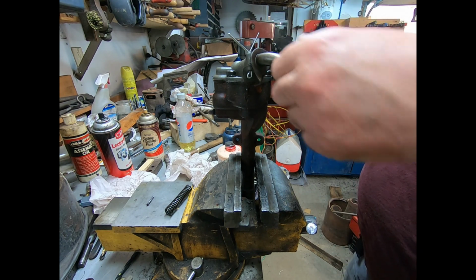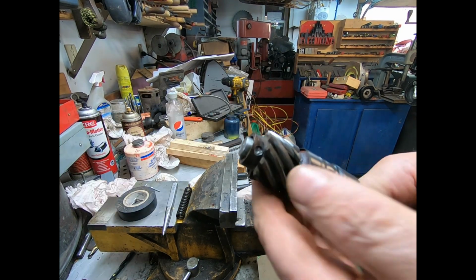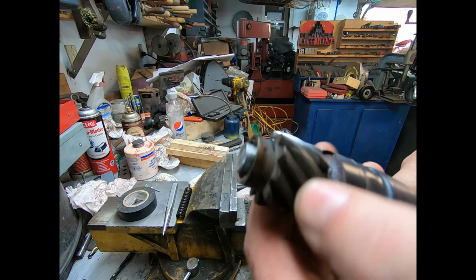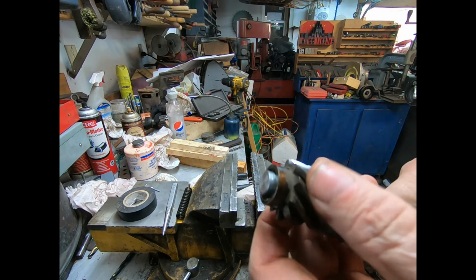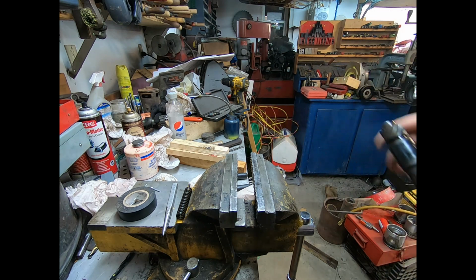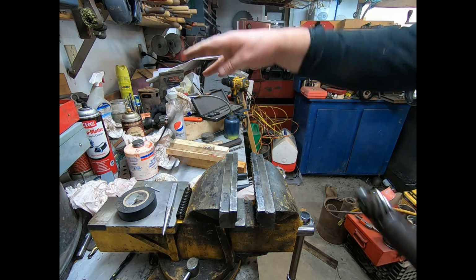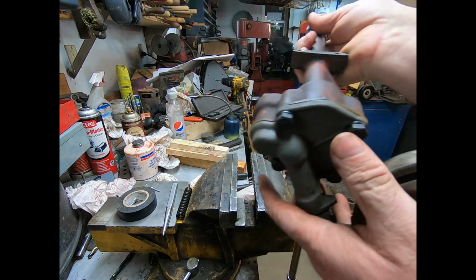And oil pump will be rebuilt, except for that one pin. And I'm going to do that off camera. That's just a drilling job. I don't know if you can see where I peened that or not, but after I got it driven through, I peened both sides real good, so it was tight. Anyway, now I can take the black tape off it. I didn't want nothing to get into that. So there, that is one rebuilt oil pump.